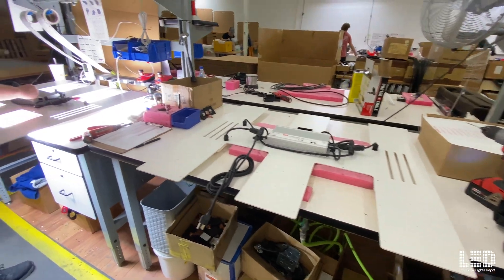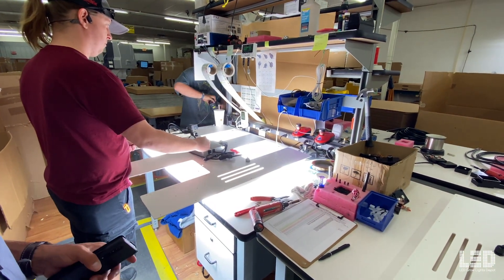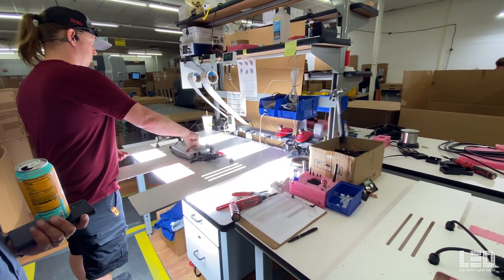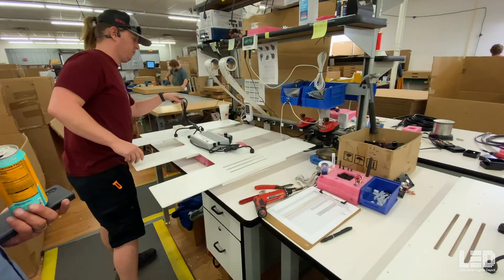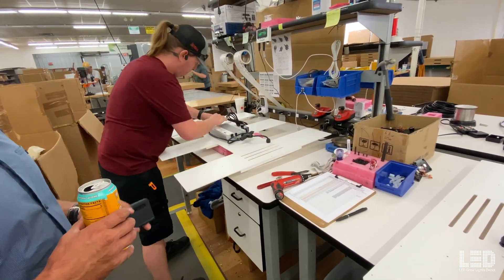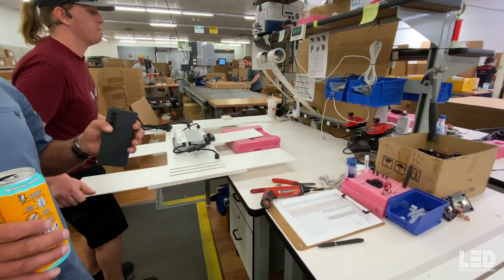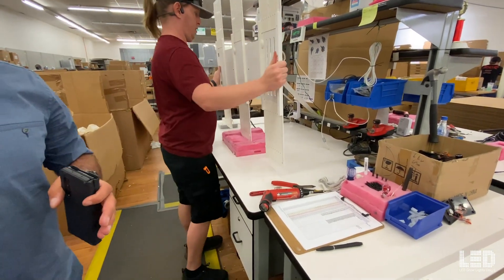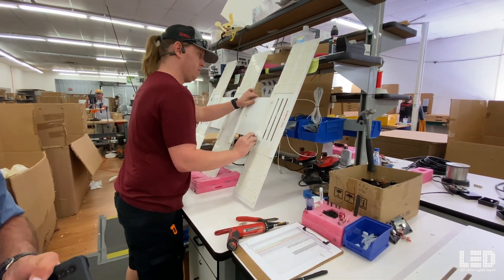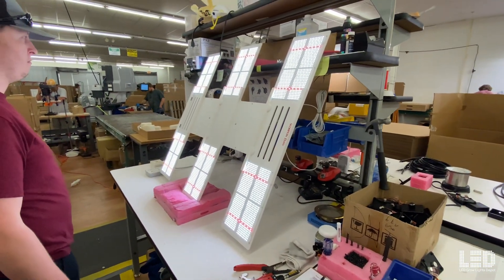At the end of the line, he tests all the lights to make sure the exact power output is correct with tuning, then runs the high pot testing and certifies them for UL certification — it's an ETL-certified factory. We do a high pot test to make sure the ground is very well conducted, so that if anything goes wrong — a lightning strike, for example — the fixture will pass that power into the ground. If you had your hand on it and lightning struck your house, it wouldn't get you; the current would continue down through the ground. They get tested at the end of the line and then tested again together after everything ships.